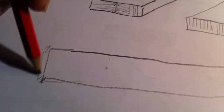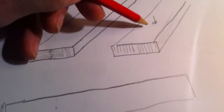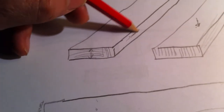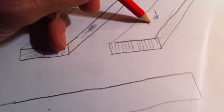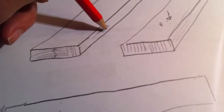So you see the grain is vertical grain. So what you can do then, especially if you have a band saw, and this is actually a way that you can make your ribs with less wastage. So you have your rib shape template, and you put that on this surface, okay? So you put it on that side. See, when you're doing it this way, your ribs are going to be, like, that's going to be the face of the rib, okay? You cut like this. But in this way, you want to switch it, so the face of the rib will be there, you see? So that way you'll end up with a vertical grain, right? Because the face of the rib will be there, not from the side.